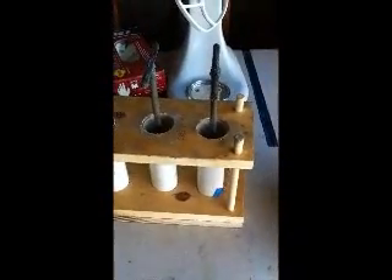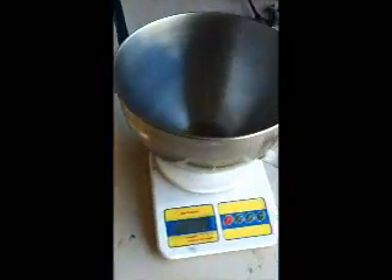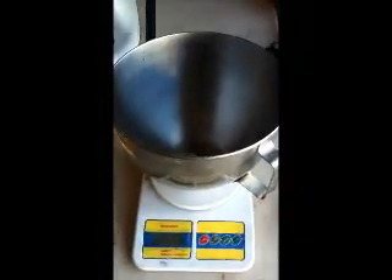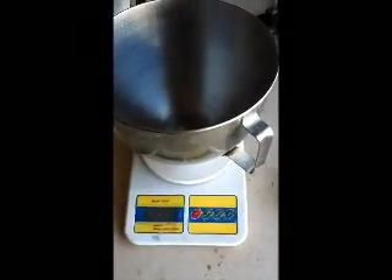I'm going to be mixing up a batch of Double D Black. This is a formula that I got from the vendor that I'm picking up all of my materials from. As you can see, I have my casting tubes already set up here, my large scale — this is for pouring liquids and measuring the larger stuff — and then I have a small tenth gram scale that I use for measuring my metals, because it's important to get accurate.